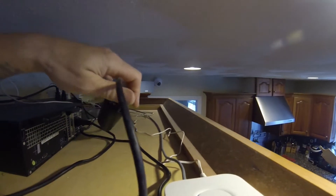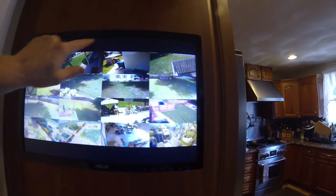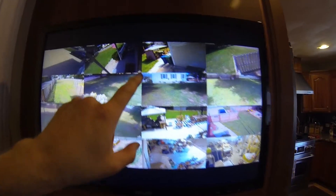Let's plug in the HDMI. Here we go. HDMI cable is plugged in. And here is the 16-port view — and you can just see how horrible it looks. It does not fill up the entire screen, and it's super low def. You can't even see the dates or the times. So yeah, that looks horrible. I'm pretty sure — because I hooked it up to the big screen TV — that this is definitely a DVI problem, or a conversion problem.